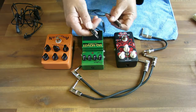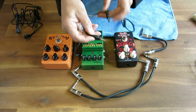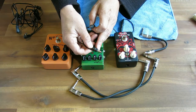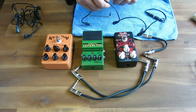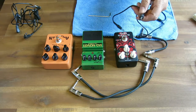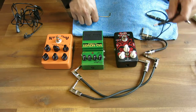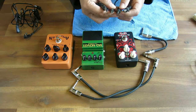I don't know if you can see this, but I've got these plugs over here, which are just pedal plugs. If you look at them in the light, you can actually see it's gone kind of dull. And this is a really good indication of this oxidation that is taking place on these things. It's dirt that kind of electrolytically gets attracted to the metal surfaces of your connectors and your plugs.